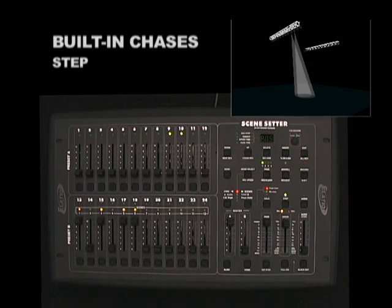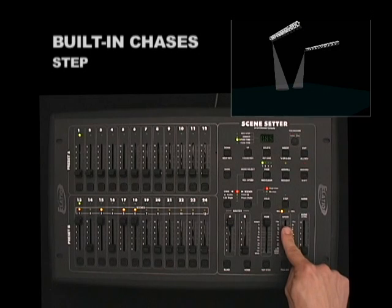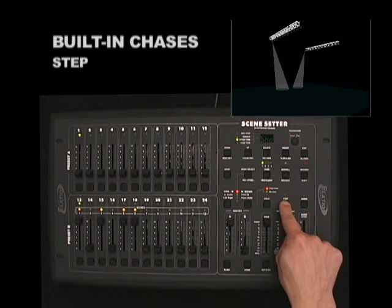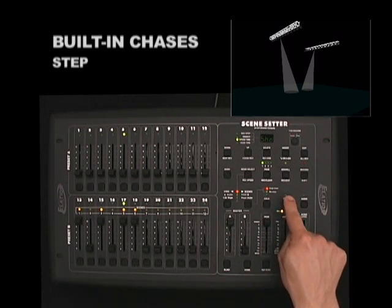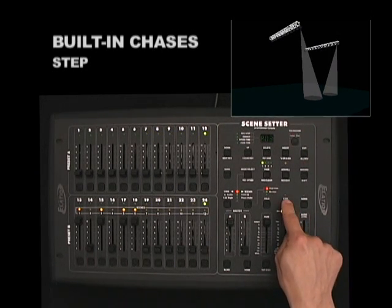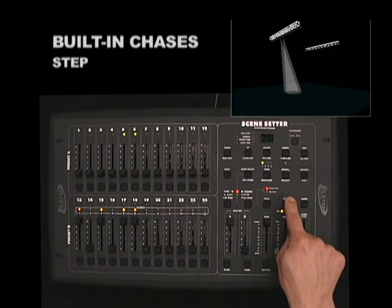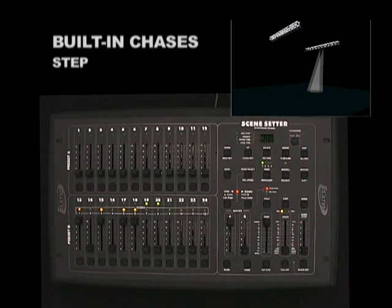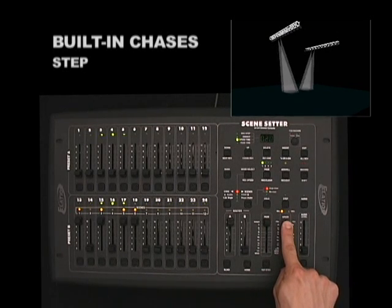If you wish to manually step through chase steps, set your speed fader to show mode or all the way down to the bottom. You can then use the step button to manually step through your chase steps. To return to the previous mode, simply readjust your speed fader to set a chase rate.